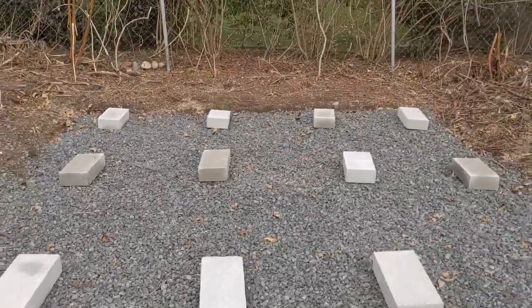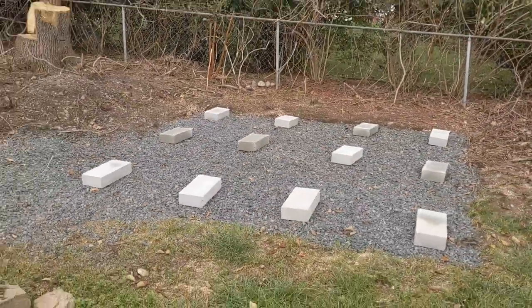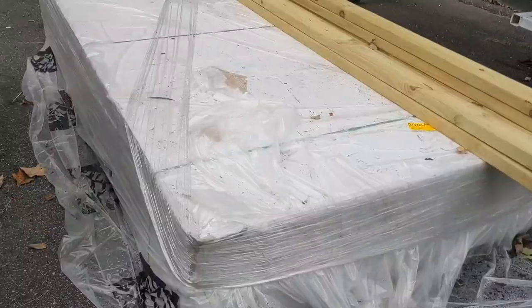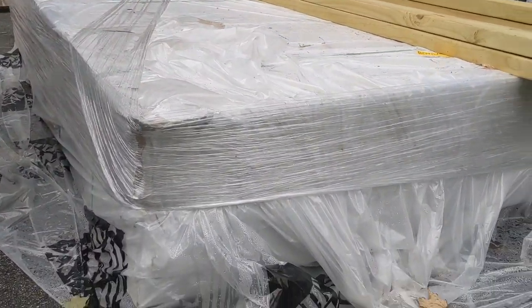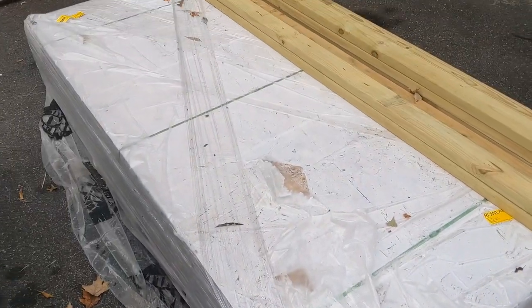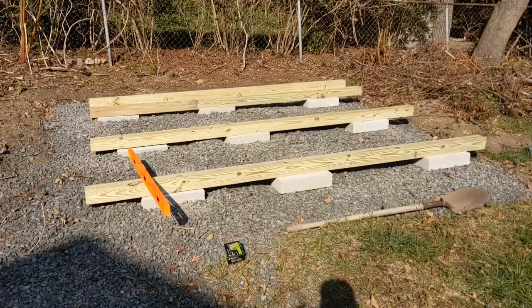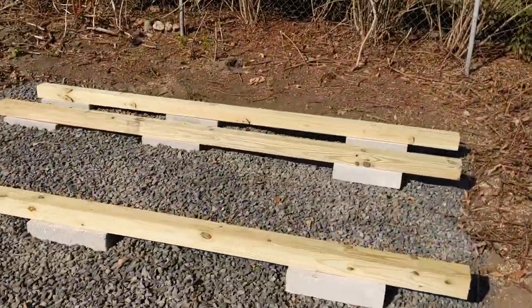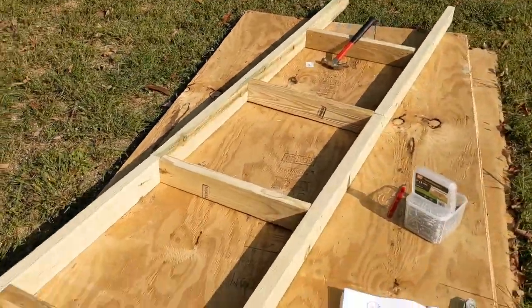That's the area of my backyard. I dug a few inches down and put gravel in for those concrete bricks to sit on top of. That is 5/8ths plywood I also had to buy separately. And that's the package that arrived from Home Depot. On top, I've got some treated lumber I bought to reinforce the floor. Put down those 4x4s, also bought separately. Leveled it all out.